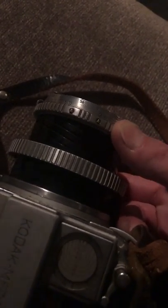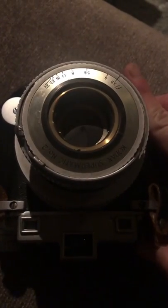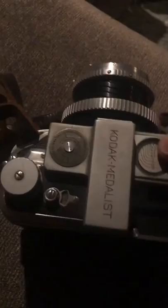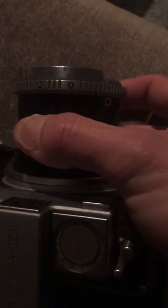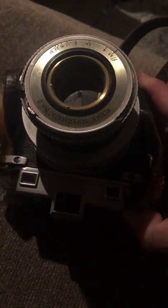Now, after a 25th, it's very difficult to ascertain a shutter speed, but bear in mind that when they work at the low speeds, they work at the high speeds. Cock. Bring her up. If that's not a 25th, I don't know what is. Now, what we used to verify the shutter was a cathode ray tube shutter test off an old television. I don't have that old television anymore, so I can't verify it. A 50th. Cock. That's right on a 50th.